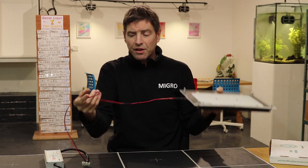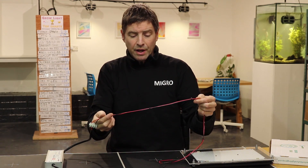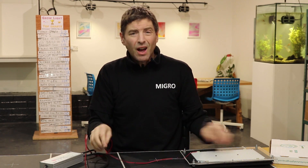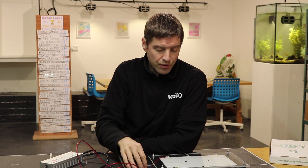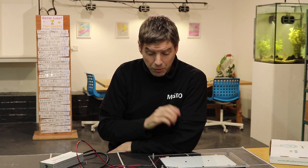For the driver connections, I've used two 1mm square cable. As it happens I only have multi-core cable. For these little connectors it is best to use a single solid core — rather than lots of little strands in the wires, a solid core will be a bit easier to make those connections, but you can use both.